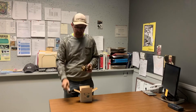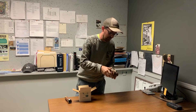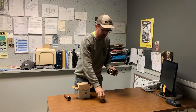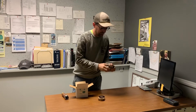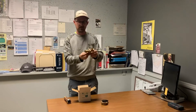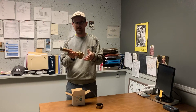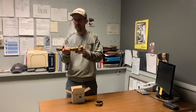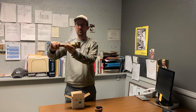You don't need these excess parts — these are for well installation only. You don't need these rubber gaskets. You can strip it down to the bare essentials for your pitless adapter. This side is threaded into the sidewall of your cistern, and it's nice and rigid with the concrete holding it in place.